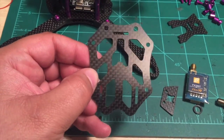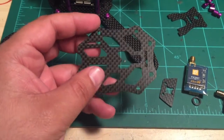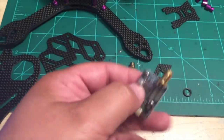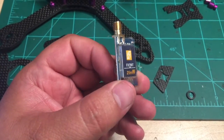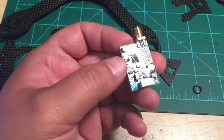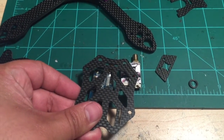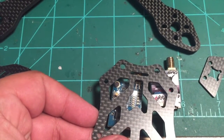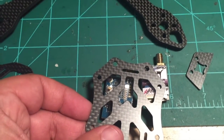Along with designing a new VTX mounting plate, I had to design a new top plate. One of my priorities was to make this top plate so that you had access to whatever form of channel-changing device the VTX has. I've kind of stuck with the same VTXs I had before, except now I've added this one into the mix — this is your standard FX799T. This is a 25mW version, but they come in 200mW and 600mW and they're all about the same size. The key difference is that these are push-button transmitters. The cutouts in the plate are made so that when you have the VTX in there, you have access to that button — it appears right down there on the left side through the hole. You can peek through it and push it easily, and the LEDs will line up with the center hole so you can see which channel you're on.